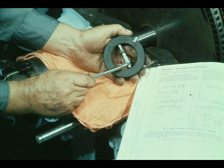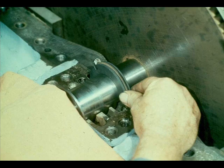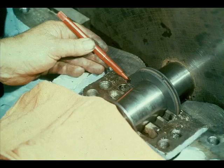The next step is to replace the carbon packing rings in the housings on each side of the turbine rotor. First, we must check to ensure that the inside diameter of the assembled rings are within manufacturer's specifications. If they are not, it may be necessary to obtain new rings. Begin with the carbon ring nearest the rotor. Be very careful not to damage the rings. It's very important that the ring stops on the garter spring be in position — they must fit in the slots in the carbon ring and in the packing housing itself. These stops prevent the rings from turning during operation of the turbine.